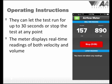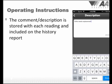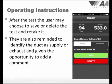One of the biggest advantages of the smartphone processor is getting a real-time readout of both volume and velocity. Once the test is complete, you have the option of choosing whether the location was supply, exhaust, or return, and you can enter comments to be stored in the history log by choosing Add a Description. Under the description section, you can store notes about the reading such as the airflow is too high or too low, and also identify maintenance needs such as the grill is broken or you can see debris in the duct. After adding the optional description or comment, you can save the reading to the history log or delete it to retake the measurement.